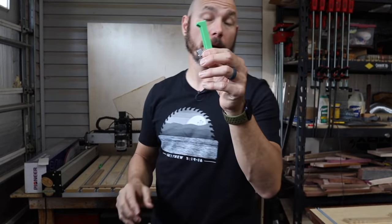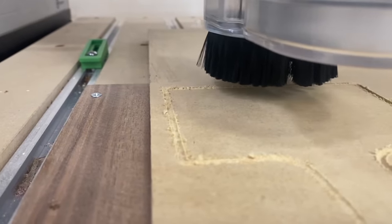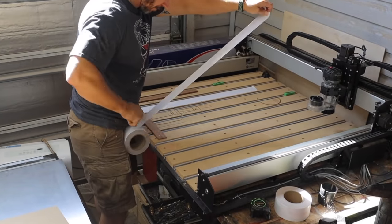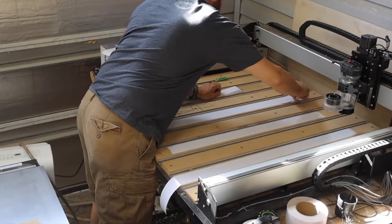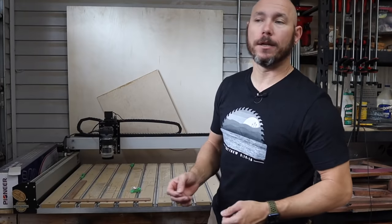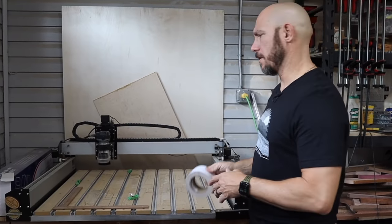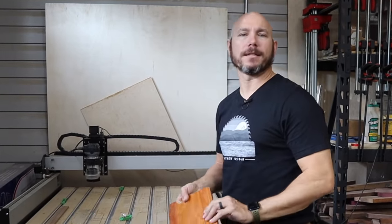Another dark side: this is the clamp that comes with the machine, and while they work extremely well, most of the time they get in the way. Sometimes your spindle or the dust collection boot will hit the clamp and cause problems. I've been using double-sided tape and I use a lot of it — just regular double-sided tape. I'll put a link in the description. It works extremely well; I've had no issues only using double-sided tape. Some people use masking tape with CA glue, but that can get fairly expensive. This tape is a couple of dollars a roll and holds the work extremely well for cutting trays, templates, things like that.